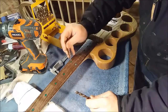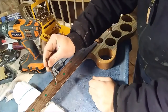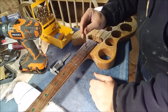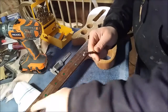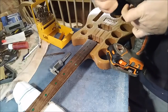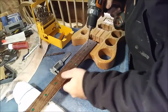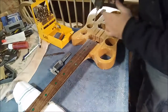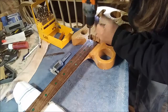What I'm going to do first is take a smaller bit - probably five thirty-seconds or eleven sixty-fourths, something about the size of that tip, maybe a little bigger. I'll go to the drill press and drill a hole in the center of each dot first with the smaller one. That way when my big drill bit comes in at the exact size, it won't wander - it'll go right down inside that hole where it needs to go. I'll eyeball the center as close as I can and then take it to the drill press with the right size bit.